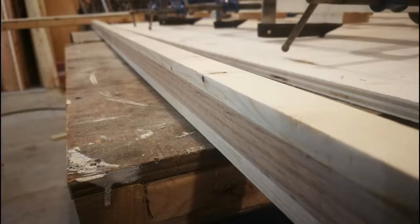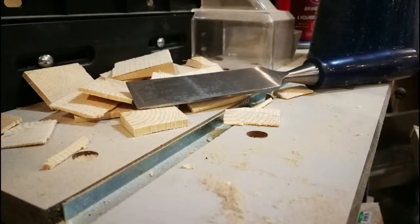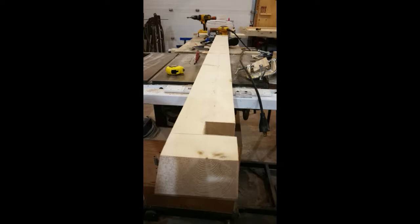In addition to that, attached around the edge underneath are two-by-four pieces that I've run through my planer and brought down to a nice edge. I've marked where I'm going to have them notched together using my vertical bandsaw and some chisels to chisel out the pieces, then file them down and notch them together. These go around the edges of the table, creating what really stiffens it up and also provides where the legs are going to attach. Each piece is notched the same with a 45-degree angle on the edge, just to add a bit of appeal.